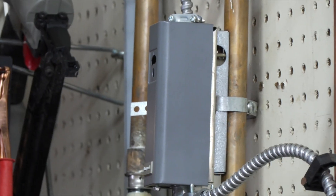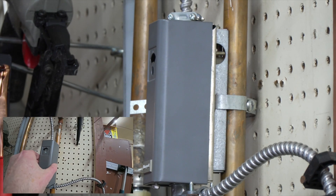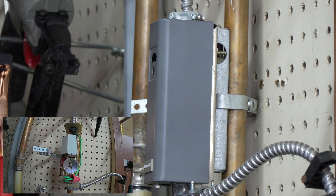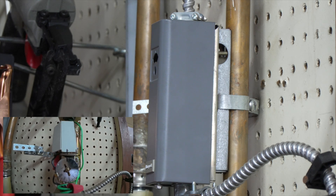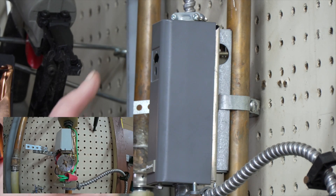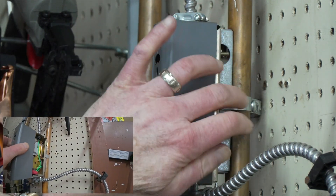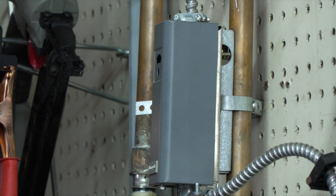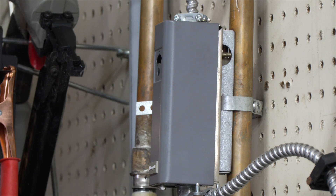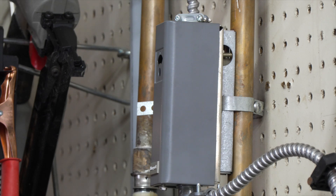What this is right here is an aquastat. An aquastat is basically like a thermostat. It's sitting on the pipe that comes in, so the hot water comes in through this pipe, and there's a strap attached to a little sensor in the back of this thing. The sensor tells the fan to come on. You have two different parts: the sensor and the fan, which is the electricity, and you have the thermostat.